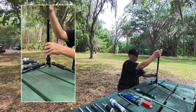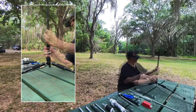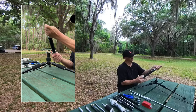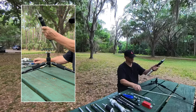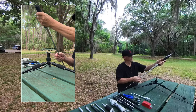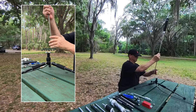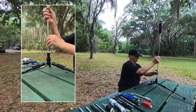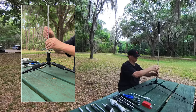To adjust for resonance on a frequency, you slide the coil up and down and then check it on your analyzer. If the Super Antenna is your thing, it too has a 3/8x24 post that fits with this tripod system. The whip that comes with this kit is unbelievable — you can coil it up into a really tight circle to put in a small go bag, and when you get to the operating site, uncoil it and it just straightens up and does the job.